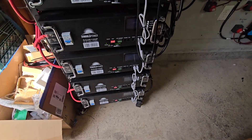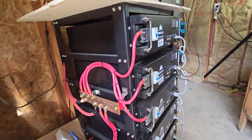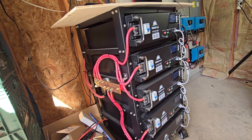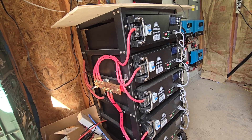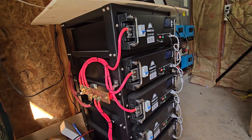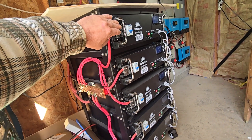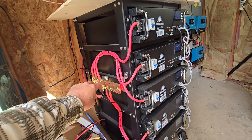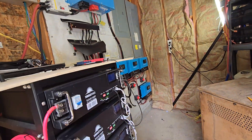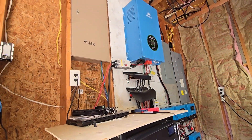I put bus bars on this rack along with some heavy duty coasters. Will — you'll find him on YouTube, he is just beyond his age and wisdom — basically I watched one of his videos and he said put everything on a bus bar. He said do not jumper from battery to battery to battery, because when you draw power it's going to drop mainly from one end. Put it on a bus bar so it draws from all of them at the same time. So I have one main cable coming from the breaker over at the charge controllers, and the other cable goes up and feeds the inverter.